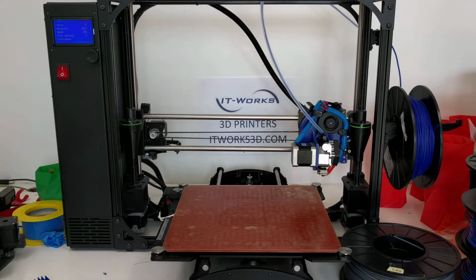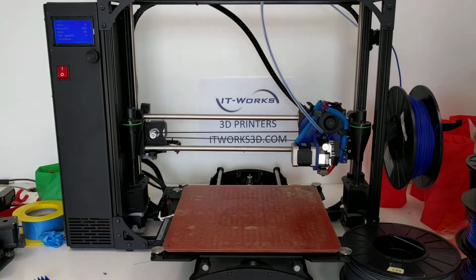As it's heating up, a few of the things that are neat about the E3D Titan Aero: the gear drive that they have is very strong, and the filament path is tightly constrained, and that makes it really good for printing flexible filaments. We also offer this tool head in a 1.75 millimeter filament version. We've been printing both commodity TPU, flexible materials, which are more widely available and at lower price in 1.75. We've also been printing PLA with it.